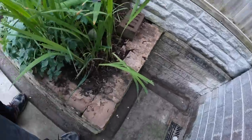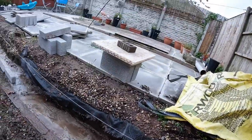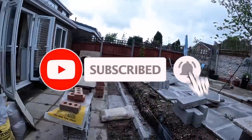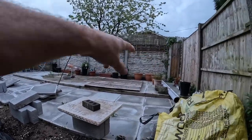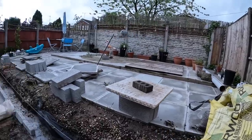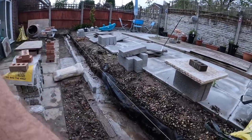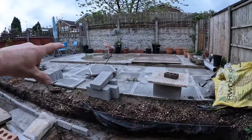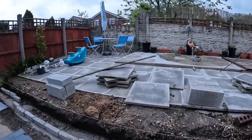So there's our little footing that we put in. We're just skinning this wall up. The wall is following this patio, so everything's squared off the patio. So this patio isn't square. It's like, which one do you do? They're just relaying the first four rows here and leaving the top bit. So we've got to follow what's there. So when this side's done, it'll just need piecing up along here, but that's down to the flagger. Like I say, they want to get someone back to relay that four rows, which are just chucked on sand. It's an absolute disgrace.